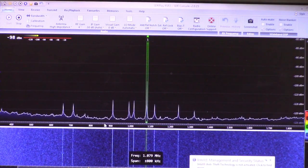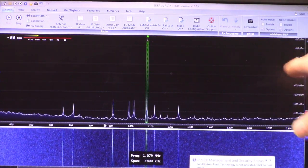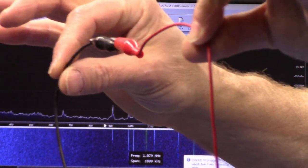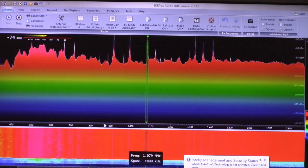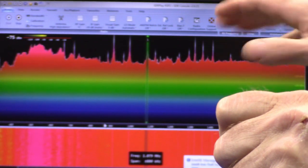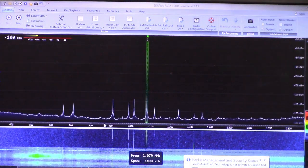I'm back. We're tuned to the broadcast band — 400 kilohertz on one end, 1800 kilohertz on the other. That's the AM broadcast band. There's a little bit of energy getting in because of the two clip leads. How many of you guys suffer from this? Unbelievable overload — and that's just me acting as an antenna, just holding on to the wire. There's just a ton of noise, overload, intermod products being generated from all those really big broadcast signals. Now I'm going to connect the loop back together.